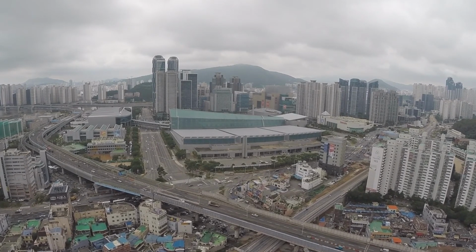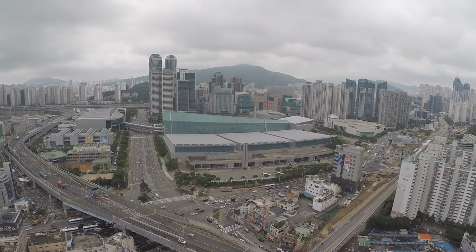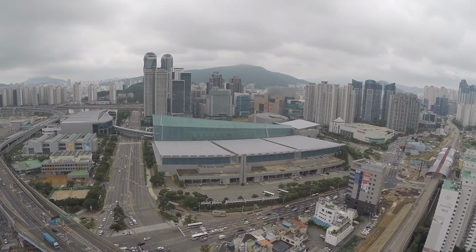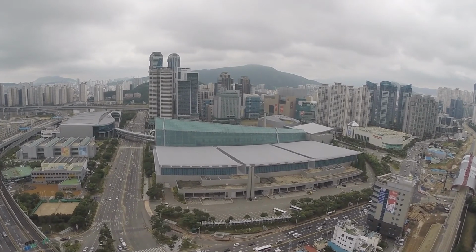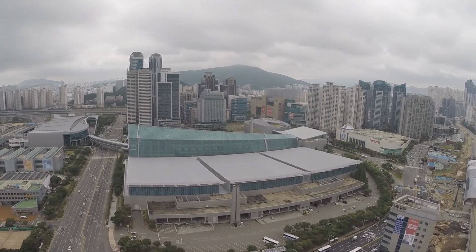Phantom is returning back. The operator probably has his FPV video signal again now that he's clear of the building. However, he's noticing at this point that he can't control the Phantom. It's still in fail-safe mode. It's returning home, which is great, but nothing he does with the controls does anything with the Phantom while it's in fail-safe mode. And he didn't know how to get out of fail-safe mode.